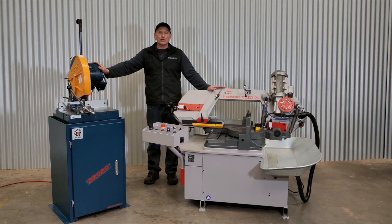The blades in cold saws can be sharpened many times. However, each time you resharpen the blade, the cutting diameter is reduced and so is the cutting capacity. A bandsaw blade typically can't be resharpened, however they have many more teeth and a longer cutting life.